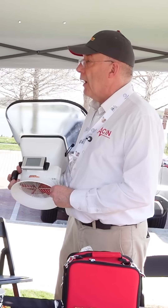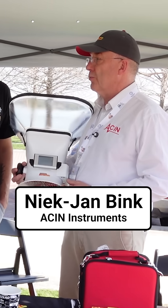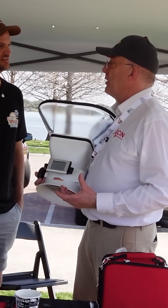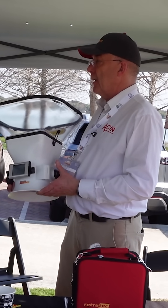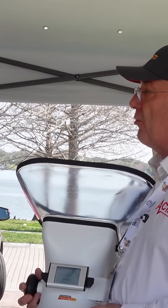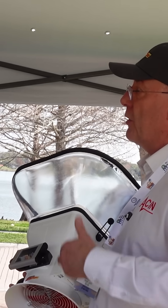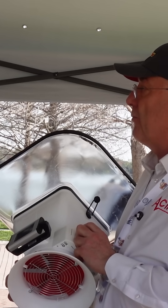We invented this. There was an old flow finder — you can see in our talk tomorrow — there is a mechanical flow finder, and the measuring principle with a calibrated fan is old, but making it into a portable machine is relatively new. We have here a powered flow hood, which works similar to a blower door. It compensates its own resistance, and then the calibrated fan tells you the flow.